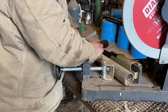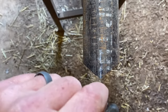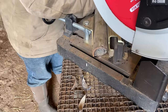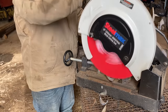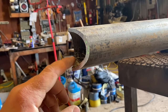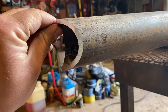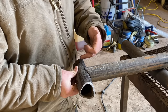Because of our angle iron and using that soapstone, we know that this end is going to line up with this end on our other side. So let's make this cut. What I like to do is come down to this end that we just cut, stand over it, look straight down at my point, and just try to line up my two points while I'm standing right above it. Roll it over, come back down this end, make sure I still like where my points are lining up, and make my cut. So now I've got my saddles on each end of this pipe. Since this pipe is so thick walled, all I've got to do is come back in here with a little grinder and grind off these tips — grind down the inside of these points just a little bit. Once you grind down them tips a little bit, it fits right into your other pipe just perfect.